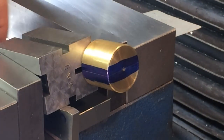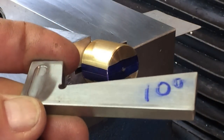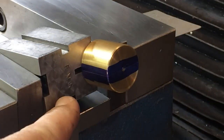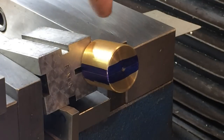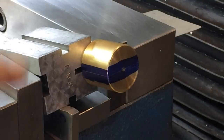What I have here is a big parallel sitting in here, a v-block, and one of my little angle blocks. This is my 10-degree block — I wrote on there for you, I don't have them stamped yet. Actually this is my 15-degree one I have in there, so it's set in there like that, tight against the vise, and it seems to be really rigid. I think this is going to work — the brass is pretty easy to cut. So that's the setup, now set at 15 degrees.